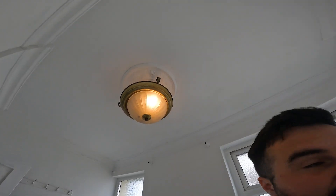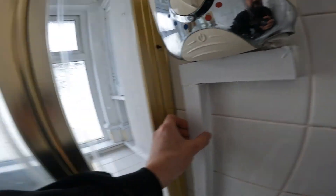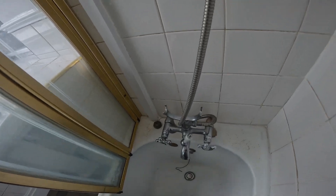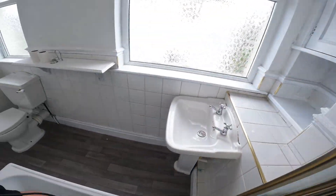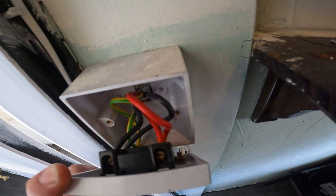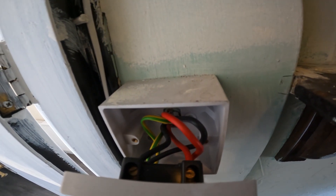Not only have we got a non-IP light, we've got a shower cable coming through this trunking system - very, very waterproof trunking system. And it just goes into the bottom there. But it's not even working. I think what they've done is disconnected it because the outlet's gone - it just stopped working and the quick fix was just to cap it off. That shower's disconnected then. So what we've done is connected it up live from the board and we've got a result. We're just going to have to test it here because it's disconnected.